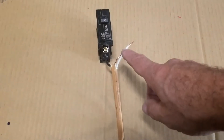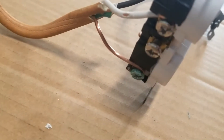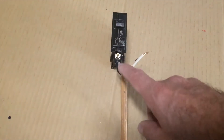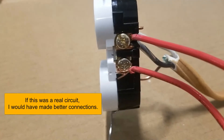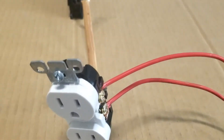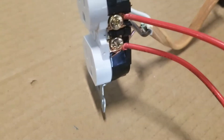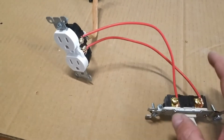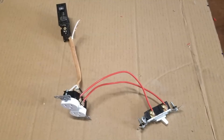Okay, I'm back and I got it wired up. The white wire is coming in and going to the side with the silver screws, just tied in like a normal outlet, with the ground wire coming in as well. The hot wire coming in from the breaker goes to the top screw, and the center tab is broken so it's on its own — that makes the top outlet always on. Tied into that hot wire is a red wire going into one side of the switch, and on the other side of the switch another wire goes back and ties directly into the bottom outlet. So whenever the switch gets flipped, it sends power through and powers on the bottom outlet. That's basically it — a basic overview of how you control an outlet with a switch, also called a half hot.